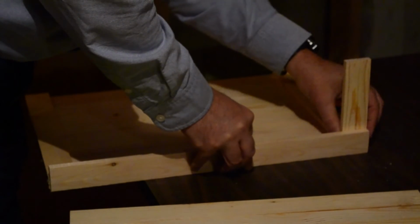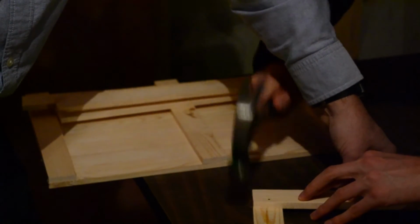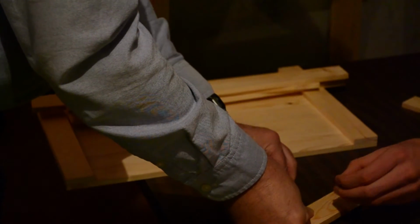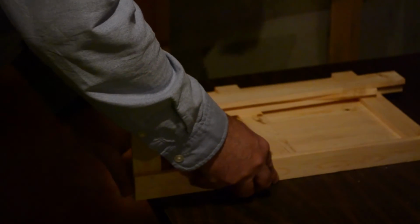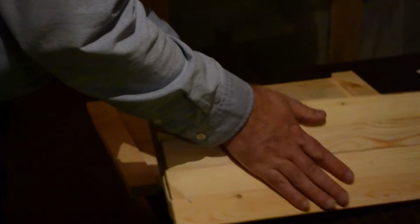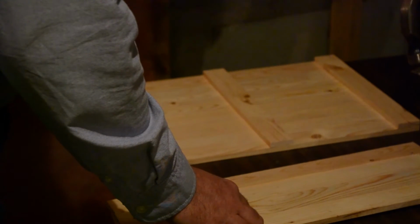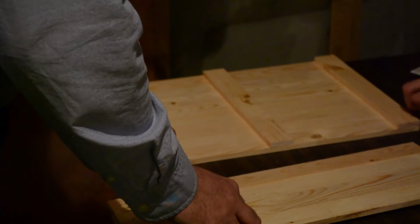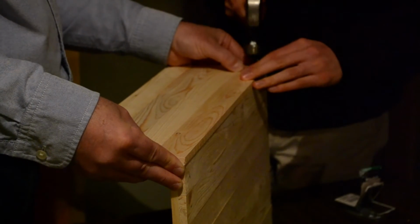We'll measure things up directly so that we get the best fit. And again, a single brad nail will hold everything together nicely. We'll measure up on both ends, then stack the final pieces together and nail them in place. Once we've done that for one side, we'll simply use 3 brad nails along the edges to hold it together.